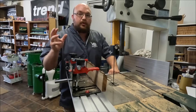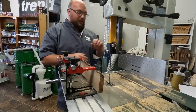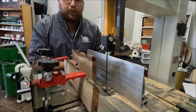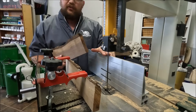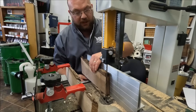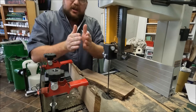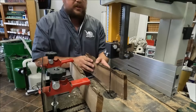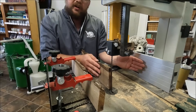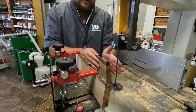The most common way to damage a bandsaw blade is unfortunately the most common way that we resaw. Most of us resawing a board - imagine we have a piece of walnut and we want to split it right down the middle - we're going to use a fence. As I split that wood down the middle, it will stress: it may open, it may close, it may twist. When that wood begins to stress, it's going to open up, push against this fence, and bind the blade.